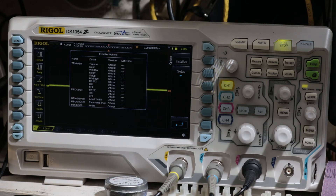One important feature I wanted to unlock — not only turning it from a 50 megahertz scope to a 100 megahertz scope while still having all four channels — is the protocol decoders it unlocks. This scope can now do RS-232, I²C, SPI, RS-485, and RS-422, and it can use all those protocols as a trigger as well as a decoder. There are also some other advanced options I haven't explored yet. Another feature this hack unlocks is increasing the deep memory storage volume — I think it tripled or quadrupled the amount of memory available for storing data points.